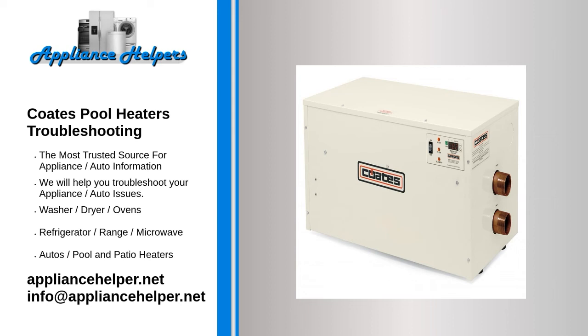If the unit is electric, make sure electrical connections are tight and that there is no corrosion at the terminals. If this doesn't resolve the problem, check the transformer by attaching one voltmeter lead to a terminal on the transformer. Touch the other terminal with the other lead. A reading of between 20 and 28 volts means the transformer is fine.